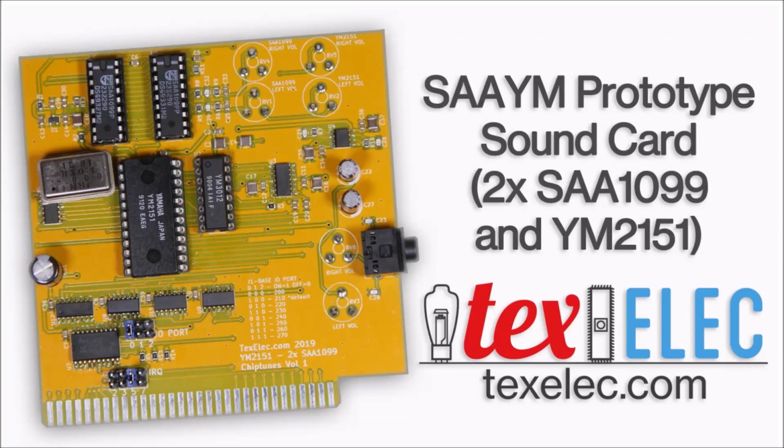Hi everyone, here's a sneak peek of the new sound card we've been working on here at TexElec. This card has two Philips SAA1099 chips as well as one Yamaha YM2151. It's designed to work with the IBM PC or clone in either an 8 or 16-bit ISA slot.